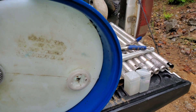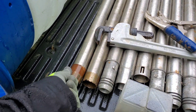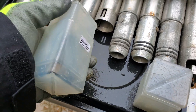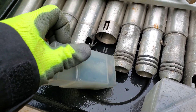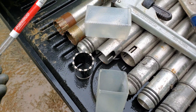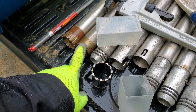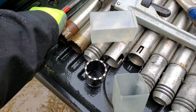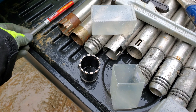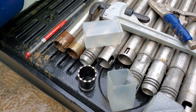It's a pain to constantly hike to a creek or river and fill up, so we've got a bunch of water here so we can get going. Here's our drill rods — got to replace this right here, we have a new drill bit, we're going to pop this one on and use that. When your bit wears down you just take a file in between the grooves and file it down. We've worn out one bit so far; this one's still got some use on it, but I think we'll start with the new one today and get set up, then we'll drill the first hole at the Camp Gold Zone.